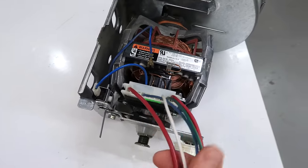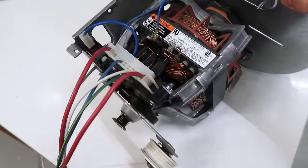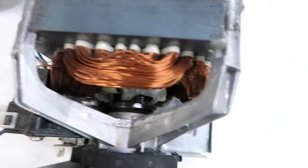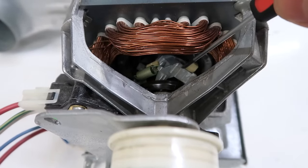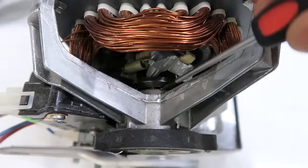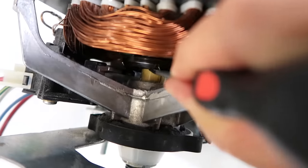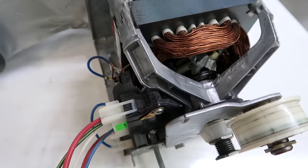It was attached to a larger wiring harness, but these are all the wires that go to the motor. This is an induction motor with a centrifugal startup switch. When the motor gets up to speed, centrifugal force pulls these weights outwards, and that in turn pulls this disc back, which lets go of this little thing here, which is on this part here — and that part is actually also a switch.